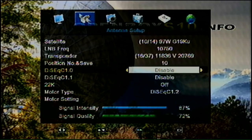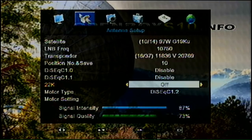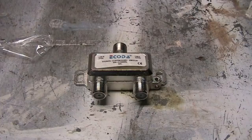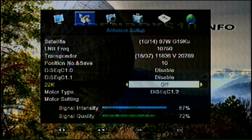For this setup I have the 22K set to off. You would only have it on if you have a 22K switch, or a satellite dish that has a 22K switch built into it — which would be dishes used for subscription services that have two LNBs. To use one LNB you leave it off, and to switch to the other LNB you turn it on. Since I don't have that switch, it's just going to send signal to this one position.